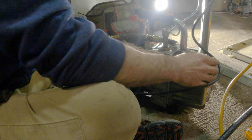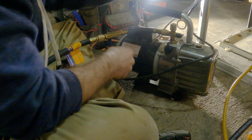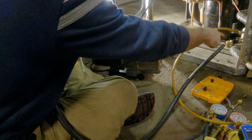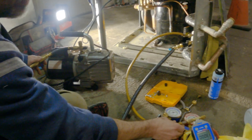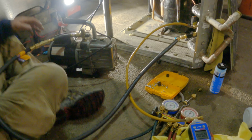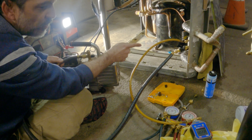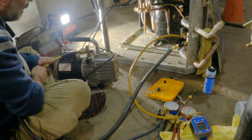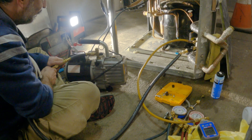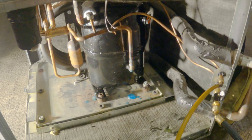I'm going to close this off and turn on my vacuum pump. Got our valve open here. We've got our micron gauge on the liquid line side, so when we're doing the vacuum we are measuring the furthest point away from the vacuum — that's why the micron gauge is on the liquid side. We're going to open our valve. While you're vacuuming, go ahead and hook everything back up.